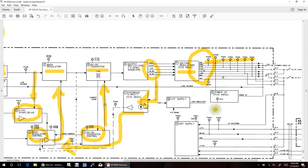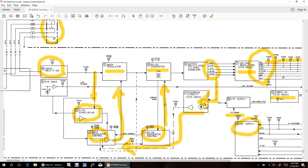After the DC-DC converter we have the main voltage regulators generating all the voltages the instrument needs, with nicely labeled test points. There's also some power-up signaling circuitry, a CRT power supply which I've removed and can ignore, and a YTF supply — possibly YIG tuned filter. Given the startup noise, I'll start investigating the kickstart circuitry and buck regulator control, since those have test points described in the service manual.